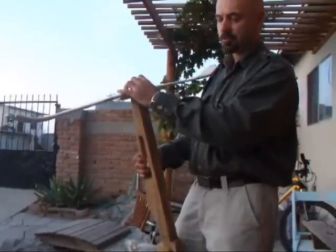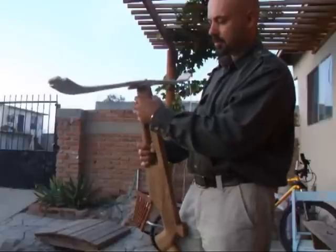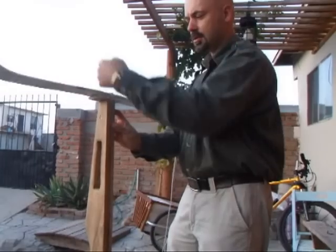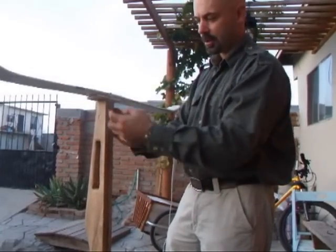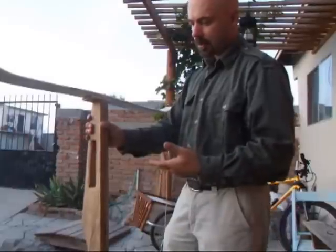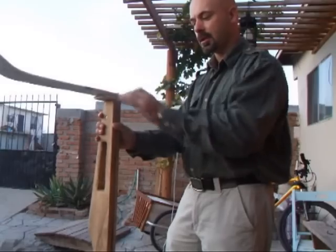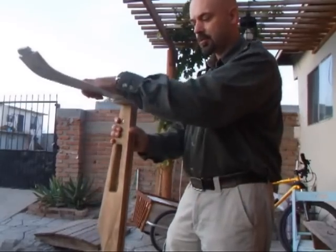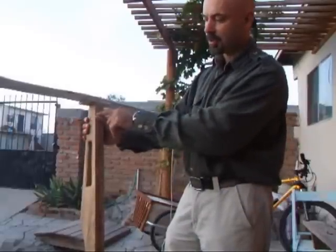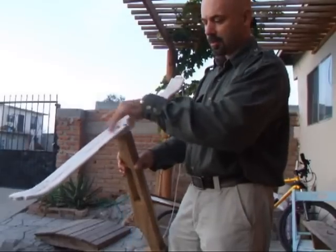So I've chosen to put another piece behind that. I still wanted the bolts on here — it just creates so much of a better connection. You can use what some people use: bolts going into the stock with windings of a type of rope line that will hold the bow onto the stock. That's fine for most applications, but I really didn't care for that style, so I chose to bolt it on. It creates a much stronger connection as long as you get a long enough bolt. I've got three inches in there. Dual bolts means that it's not going to pivot at all.